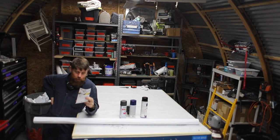Apply the film to the target surface with a squeegee. Remove any air trapped in the adhesive by carefully pressing it outwards. If you encounter creases or wrinkles, simply heat the film, reposition, and apply the film again. If the vinyl is not sticking, use heat and press the film into position. If you've stretched the film and need it to return to an earlier shape, heat the film after it's been applied to erase memory in the film.